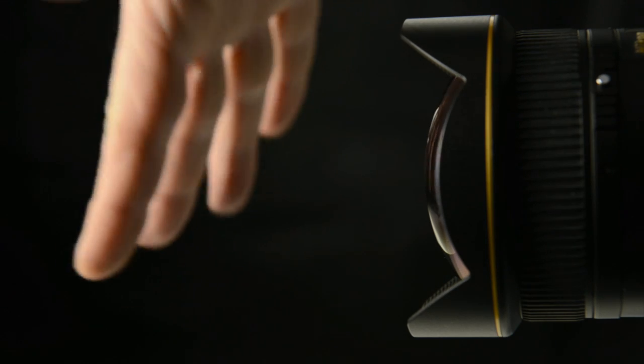Here's a tip. 3-2 pull-down removal usually requires a moving sequence of video. If the Connect is not locking to the 24p 3-2 pull-down signal, we recommend that you wave your hand in front of the camera or move the camera from side to side to aid the locking mechanism.